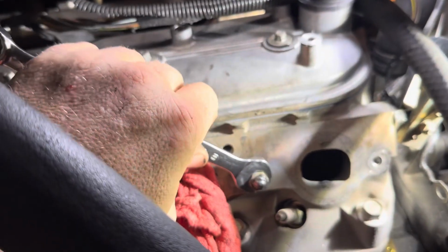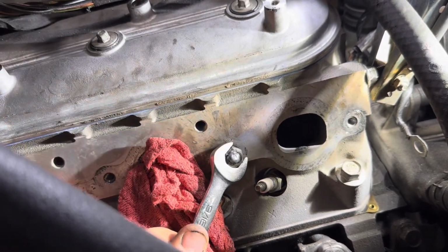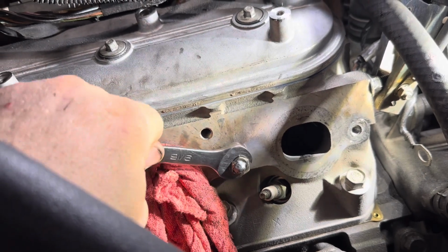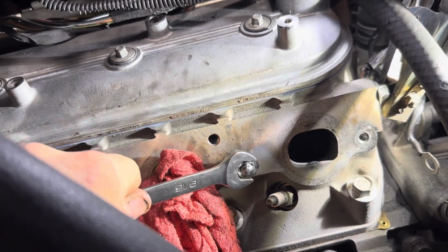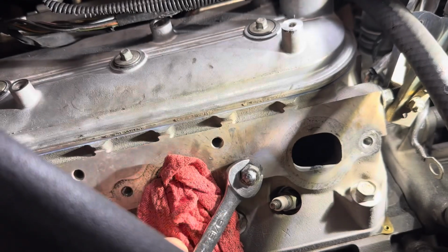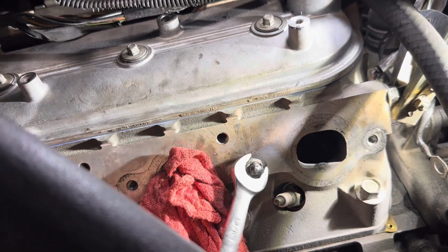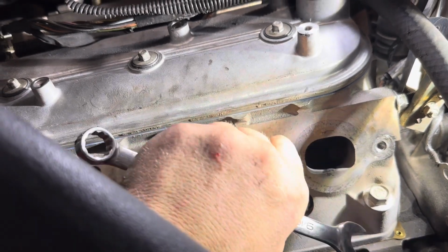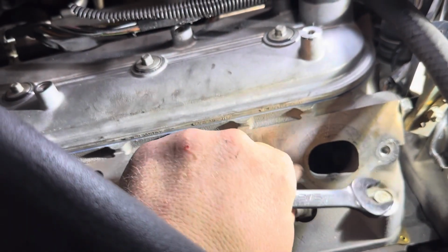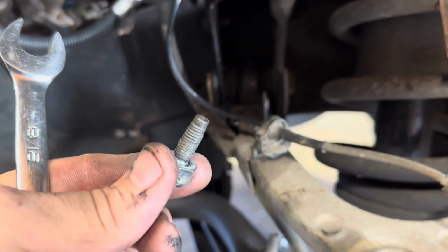Alright, so if you've got a broken bolt, you're going to weld a nut on there. A word of the wise, whenever you do this, just think cool off before you try to wrench it out. You'd be surprised, it hardens the weld up, and this thing just rolls right on out. I'll prove it to you here in just a second. I had a little experience, I know for a fact. Let it cool off. Man, she comes right out. Checked it out. I'm 3 for 3 here.